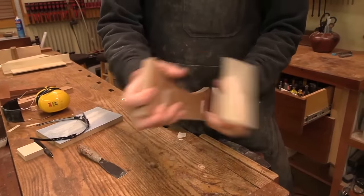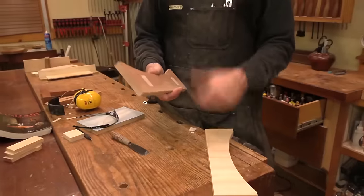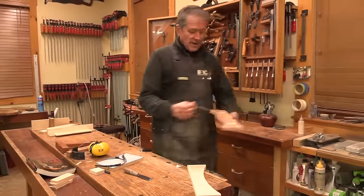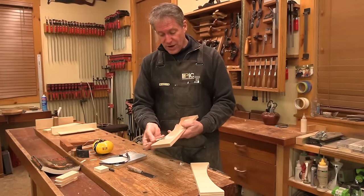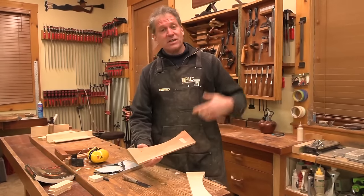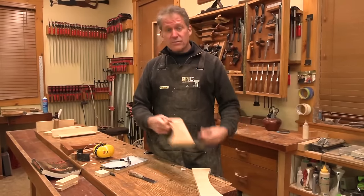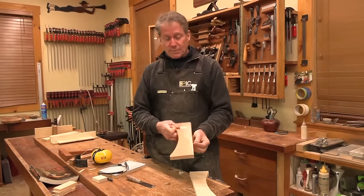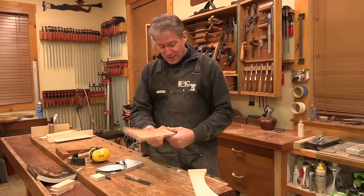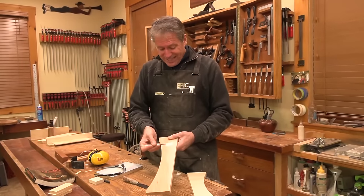The double stick tape, I have a love-hate relationship with this tape. I used to love it and use a lot, but because it's so gummy and so sticky, you have the time it takes to put it on and then remove it from the workpiece. You've seen me use other methods. Sometimes I'll use those little toggle clamps. If I set up a true jig for repetition, that's great. You can set it up with stops. Or you can actually put little brads in and snip them off. And so you get these spurs that'll actually hold and allow you to quickly move, where this stuff, not so much.